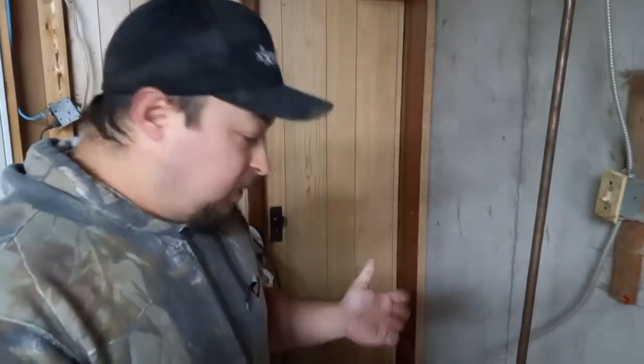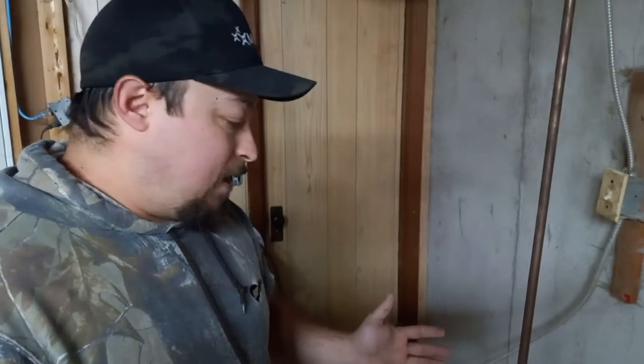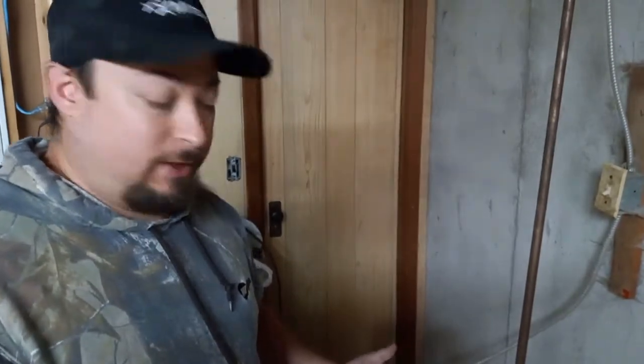It's a galvanized fitting they have coming through the cement wall. It's broken off right at the wall. No way to really repair that or patch it without digging out everything and redoing it. And I honestly don't want that cistern set up in place anymore since we have the well. We just need to have a trench to the house at some point. So we're eliminating that completely right now until we can get the trenching done.